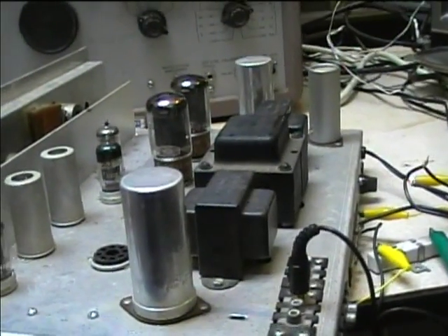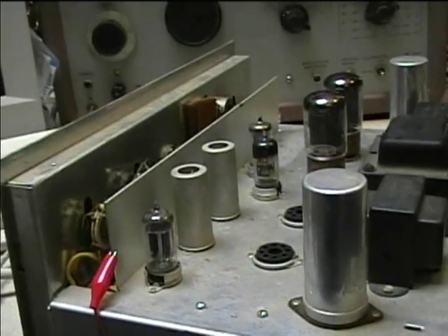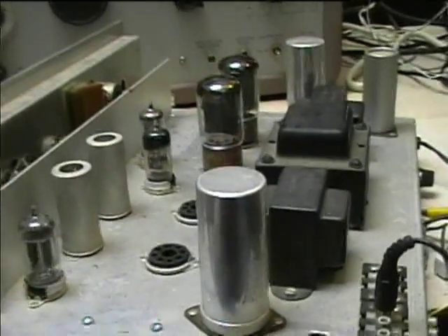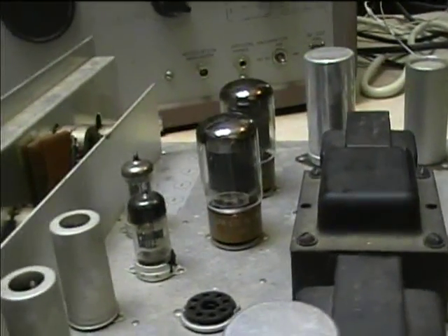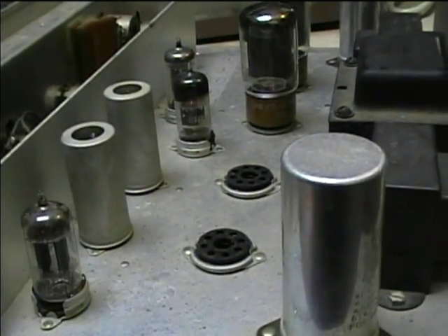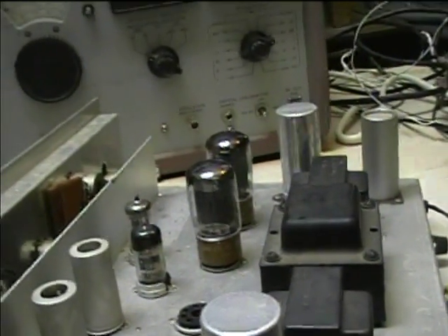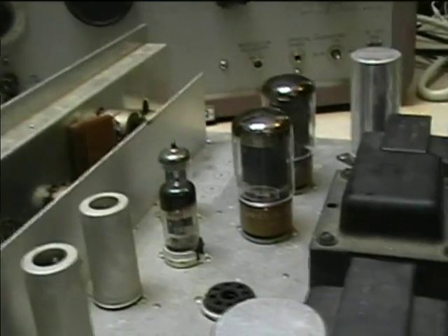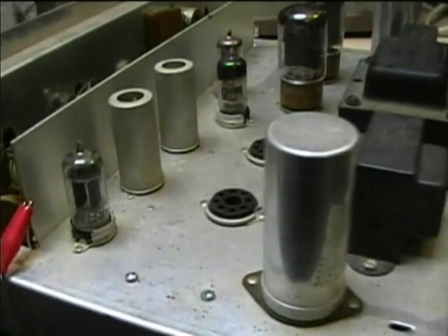Needless to say I wasn't happy. Right now I've got the Pioneer solid state amp filling in at home, but I'm going to try to upgrade this from a somewhat cheaply designed amplifier to be more robust for long-term constant use. I'm going to replace the 6v6s with 6L6GC and 5881 - I got two 5881s, which are like 6L6GB, and two 6L6GCs. The 6L6GC requires 900 milliamps on the filament while the 6v6 only requires 450 milliamps, so you need twice as much filament current.